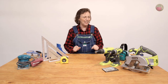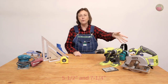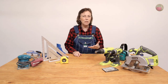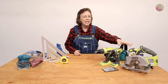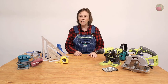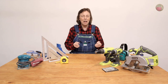Now let's get into the power tools. If you're working with wood, you need a circular saw. These come in two sizes. There's the little five-and-a-half inch — I love it, it's easy to handle, great for cutting plywood, and good up to about a two-by-four thickness. The next one up is seven-and-a-quarter inch. The advantage of the seven-and-a-quarter is that blades are widely available anywhere in any tooth count or material. For the five-and-a-half, extra blades exist but you may need to get them online. Think about what you're going to be cutting — a five-and-a-half can't handle a four-by-four leg.